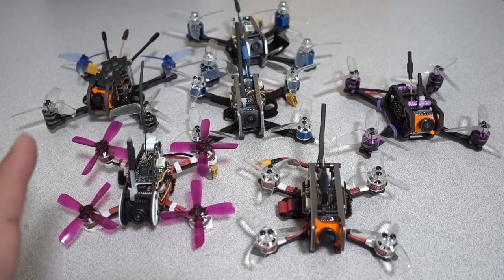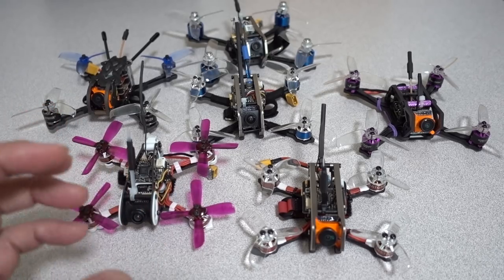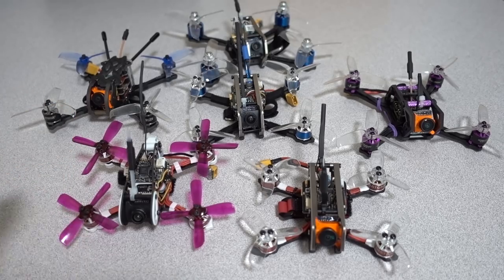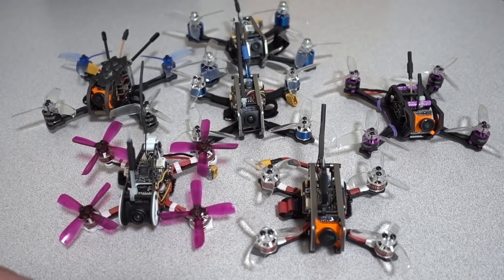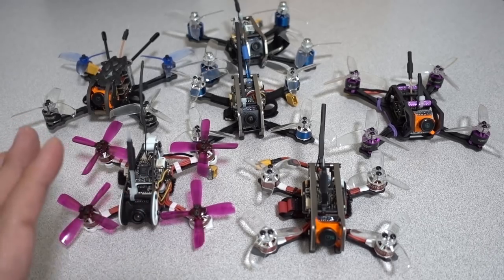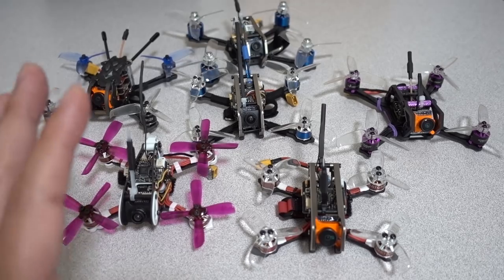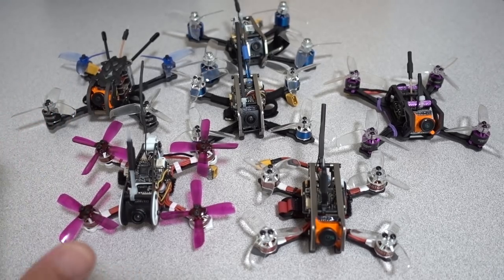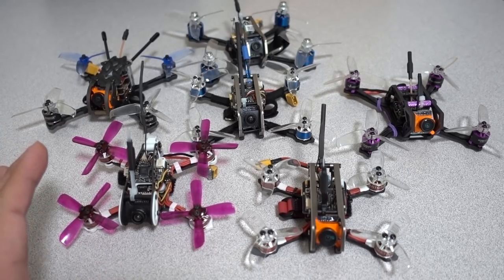There's a way to put an alternate firmware on F3 boards that has certain features enabled and others disabled, but basically the flash size is too big for that chip and it doesn't fit. I'm not going to do those models because it's a lot of extra work, and newer models are coming out with F4 chips — it's just easier to tune those.